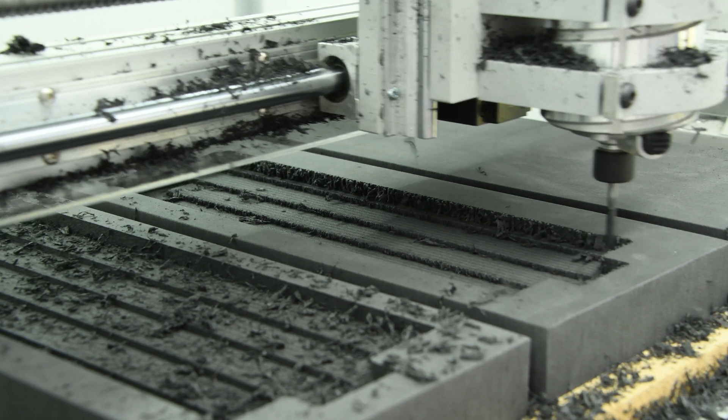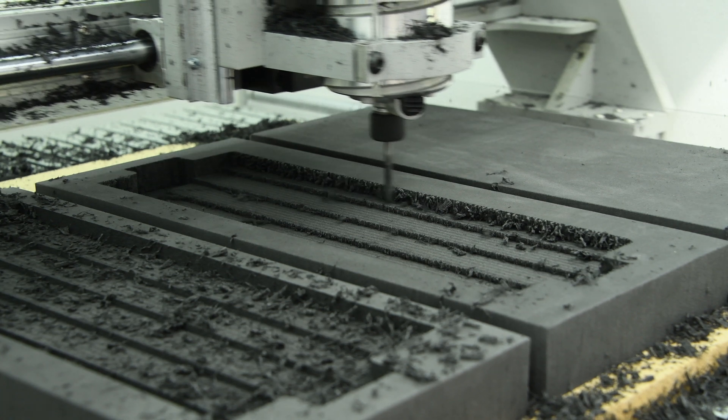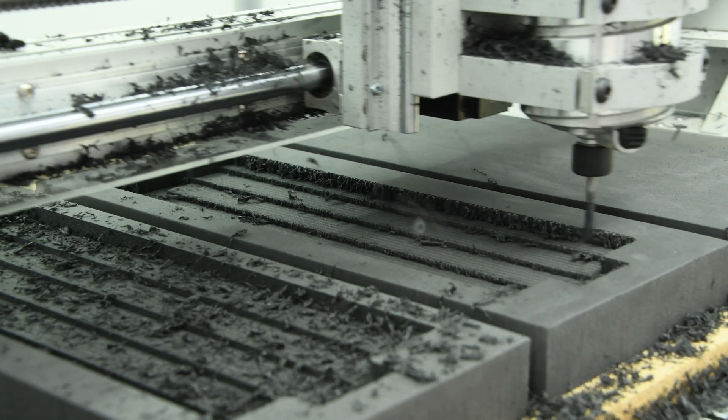Based on Winston's results, we decided to buy an end mill from Datron. It was designed specifically for milling foam, with a polished cutting edge, large chip channels, and a very low helix angle.